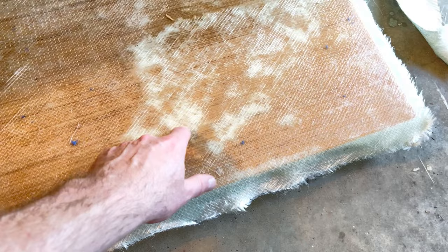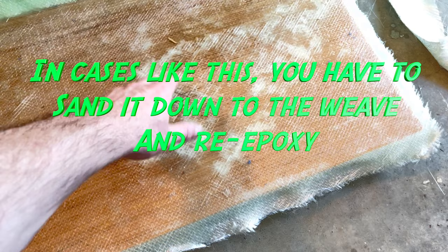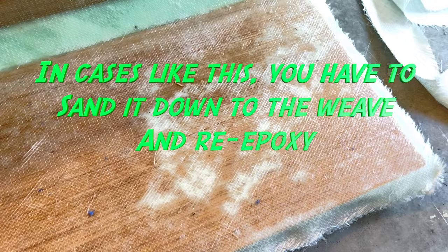We had here, the white that you see is actually fibers that were not penetrated completely by the epoxy. So what wound up happening was this started to dry very quickly and turned hard, and then the top of it would not get any underneath. I was using the bubble popper and everything, and I still couldn't get it. But for the rest of it, there are a couple of little white spots, very, very little. There's a few here and there, and that's a piece of fiber.